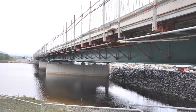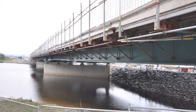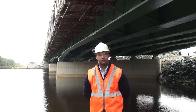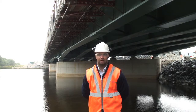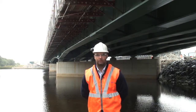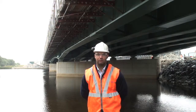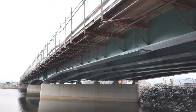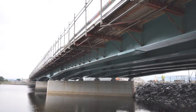Once the deck is cast on top of the bridge, the process for dismantling the RMD Paraslim is to set up a small crane on top of the deck. The units come out separately. We utilise an RMD C-hook, which cradles underneath the Paraslim falsework units. It is then released from the Paraslim tie into the C-hook, and then lowered and lifted off onto the deck for dismantlement.